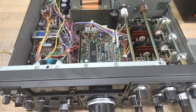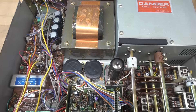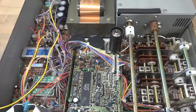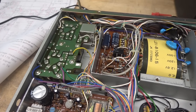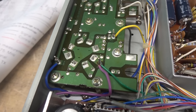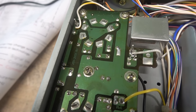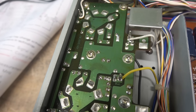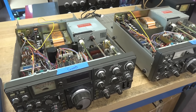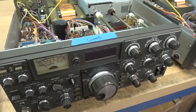Here's a quick inside shot of this 830S. This is a Gold Emblem 4 million series loaded with filters — super clean. I'm going to trace down the meter select switch cabling, see if we have a loose connection. But while I was in here, I was looking at the pins of the 6146s where they're soldered onto this board, and there's cracks around every one of those leads. I decided before I go any further, I should get online and see if there's any articles about ALC problems with the Kenwood 830S.